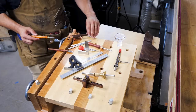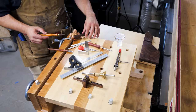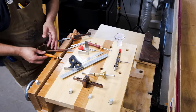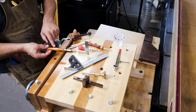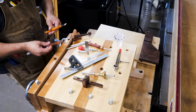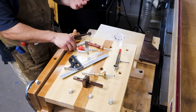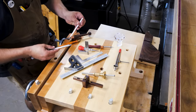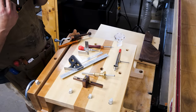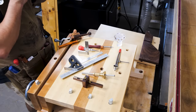This one I had made from a guy on Etsy that is really, really thin — I really like it, but it doesn't quite fit anywhere in my vest so I don't use it all the time. This Narex is kind of my favorite marking knife, and then this is a Swiss made one that I also really like. Marking knives are where it's at. Pencils are good for rough dimensioning, but they're just not accurate — a pencil line is thick, it pushes away from your square, so it's not right on your line.